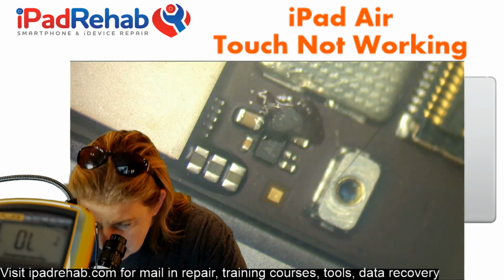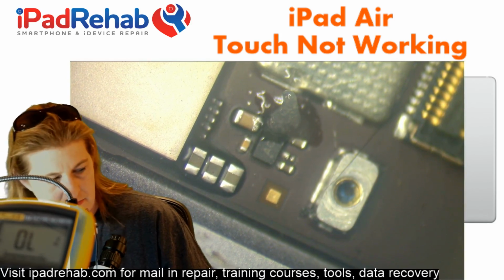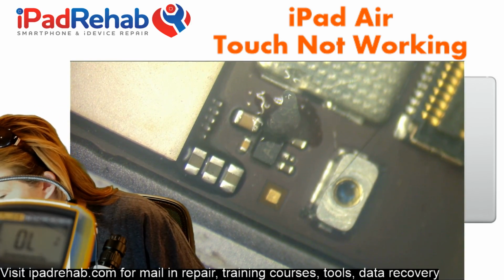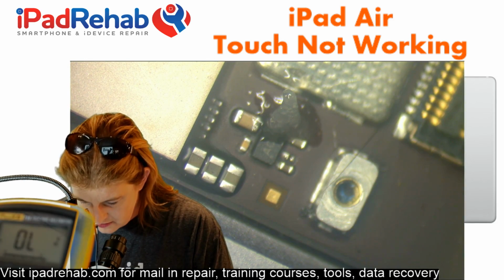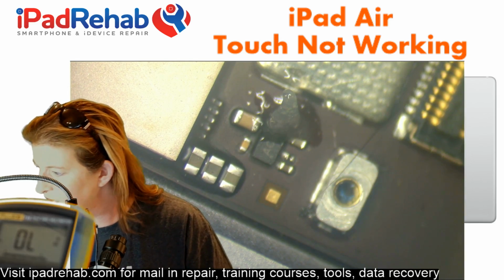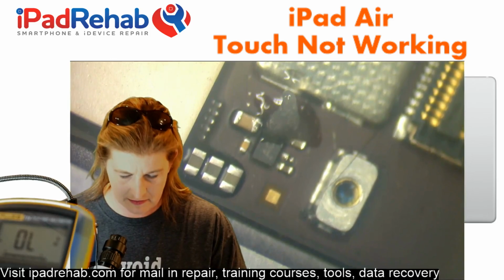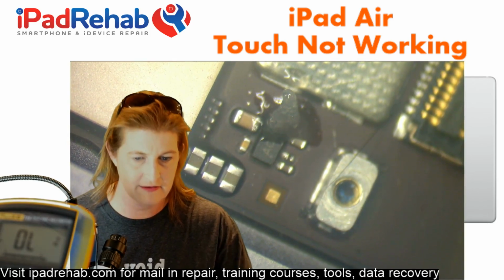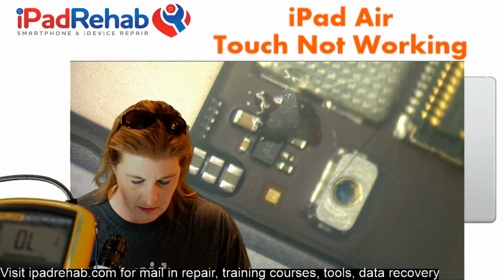Let's do it. All right, I think magnet wire is a little thin for a power line, so I would rather use just a single ply piece of braid. Let's see if I have a piece that's big enough. This is a great use for braid since we don't have to wick pads more than once a week, or if that.